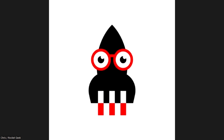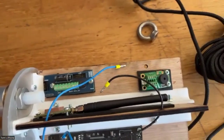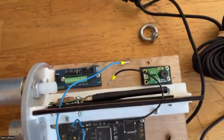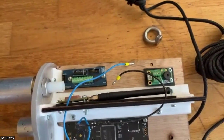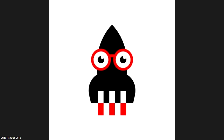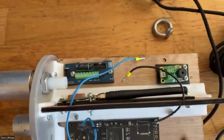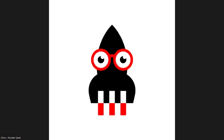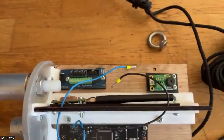So talk to me about your apogee ejection charge stagger. So as the primary flight computer will deploy the ejection charge at apogee, the secondary is set to deploy 2 seconds after apogee is detected. So there shouldn't be a simultaneous explosion from both primary and secondary charges. Which one of the flight computers is which though? The Easy Mini is primary and the RRC3 is secondary. All right. So you're going to have to change at least one of the default settings, right? Yes, I've changed the default setting on the RRC3 already. It is set as 2 seconds after apogee.